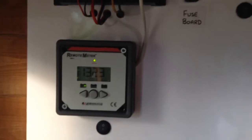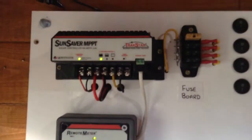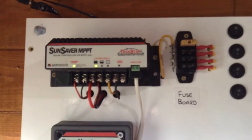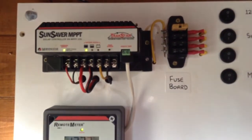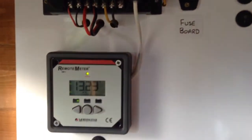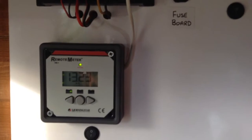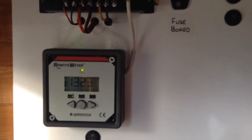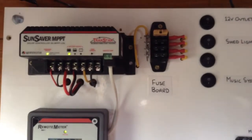The solar panel voltage is 15.18 volts. I've got just the one 50 watt panel on the roof — it's a 17.2 volt panel. An MPPT controller works better with more than one panel, as it down-converts the voltage to that necessary to charge the battery and increases the current. To maximize that effect you need at least two solar panels in series.